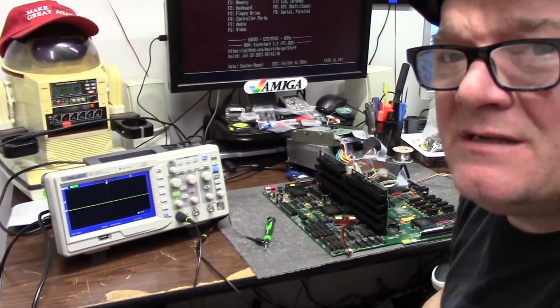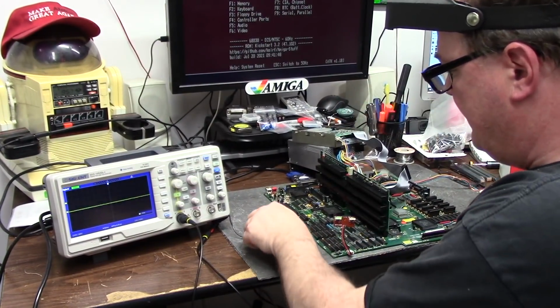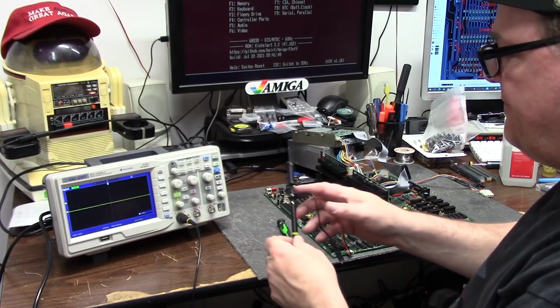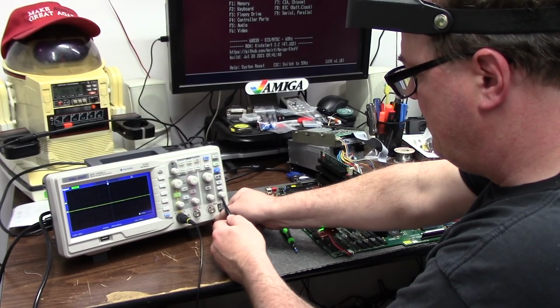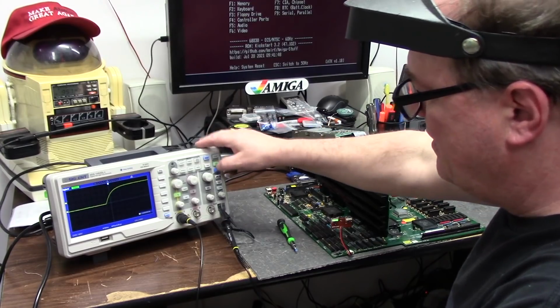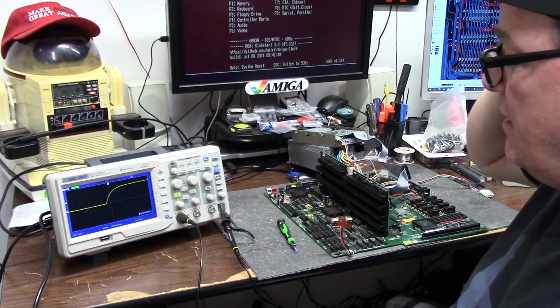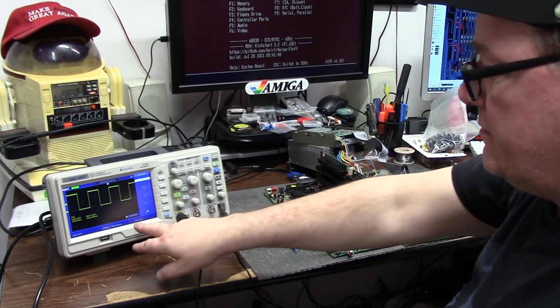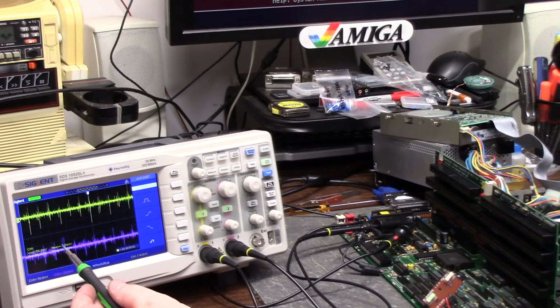So we're back with Rusty. Rusty is running. It booted fine. Low, high, Amiga test kit in the floppy drive. Before I probe this, I'm going to zero out my probe, use the 1 kilohertz generator, just to make sure I'm in a pure square wave so I don't have any weird readings. Alright, so 1.1, my adjustment looks good.